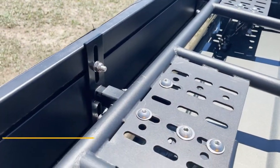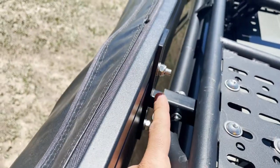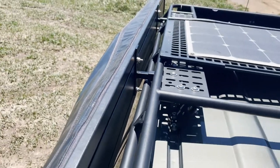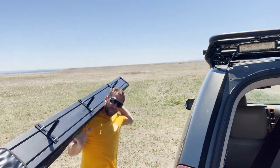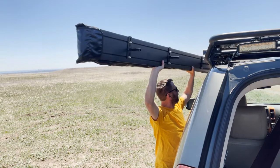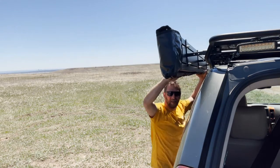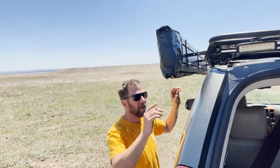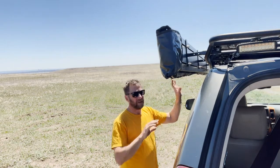A tip for when you're using three rack receivers: on the back and front ones, engage all the way to the second hole, but on the middle one, engage only to the first hole. That way you can line up the front receiver first, swing the back in, and let those engage — about an inch of engagement front and rear before the middle comes into play. It's easier to line up two at a time than all three simultaneously.